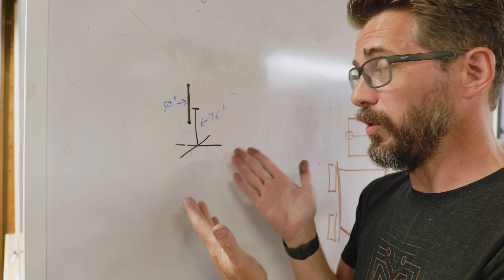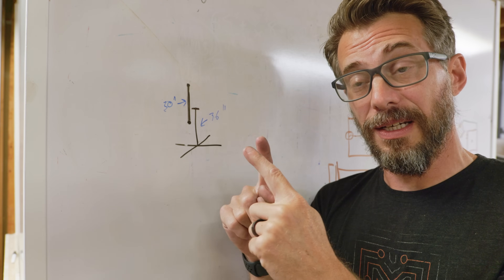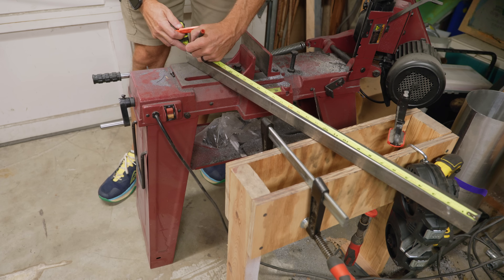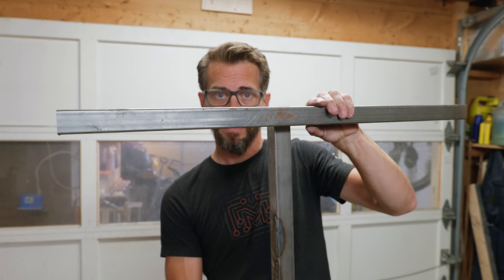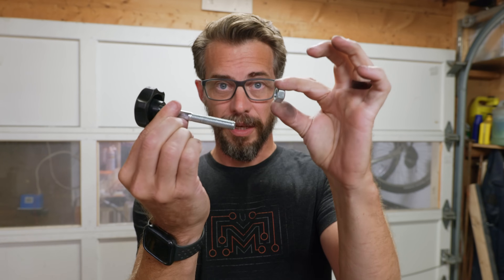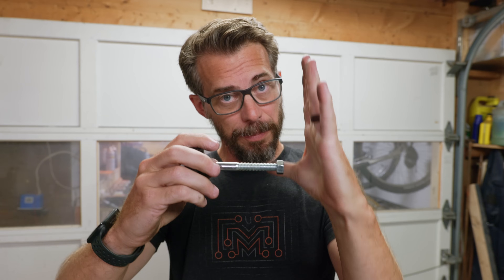Here's my extremely detailed drawing with measurements. Basically it's some sort of a base with casters, with a piece sticking out of it that holds another piece that can spin around, and on the end of that spinny piece both heaters are going to go. So I need a base and then two pieces of steel with some holes drilled in it. Both pieces are cut — one goes upright and one is mounted horizontally and needs to spin, so I have to drill a hole in the middle of one and the end of the other. To keep those pieces together I found this mystery part with a matching nut that's long enough to go through both pieces. I can tighten it to lock the angle, or loosen it to let them spin and then tighten back up.